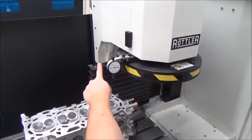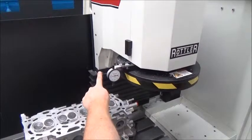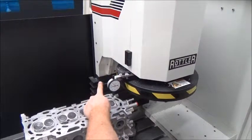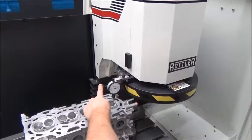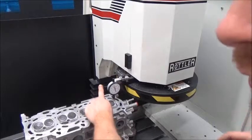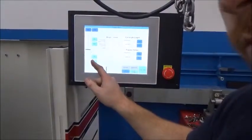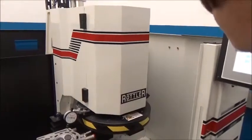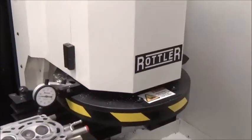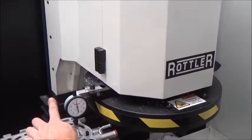It's not the exact numbers I always use, but it's a good starting point. I highly recommend matching RPM speeds and other settings for the proper material. Next step is dropping the head and finding the proper vertical and horizontal zeros — right now they're all the way up. I'm using these two sliders: one moves the head down and up, the other left and right. There's a dial indicator mounted to the fixture — I'm going to make sure it lines up with the surface and reads zero for the first pass.